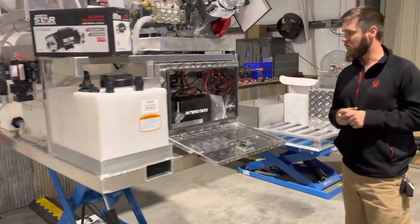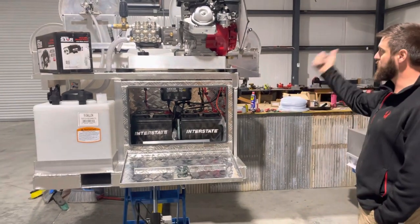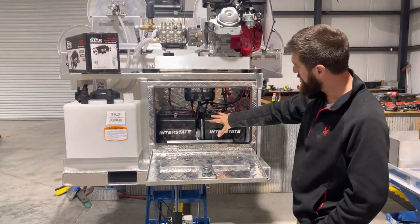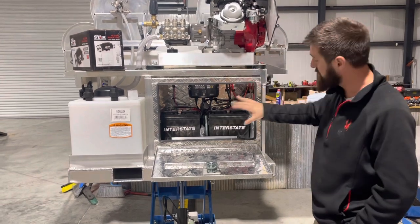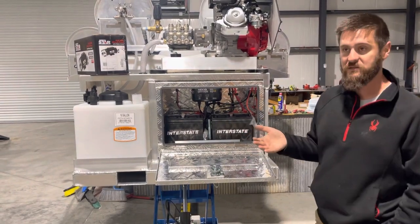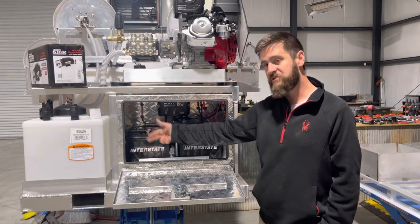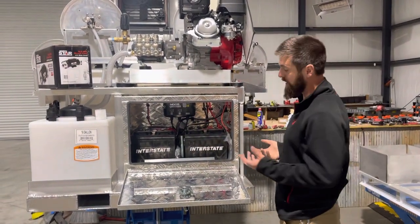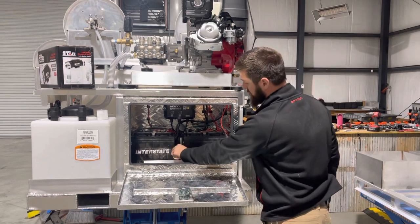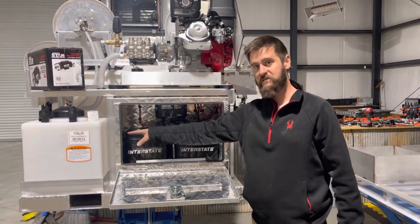There are a couple of things you'll need to do on the electrical side — obviously it's 24 volts, so a little different. This is our standard setup: we've got a 12 volt pump on this side, 12 volt pump on that side. Each has their own independent battery bank wiring — everything is independent, so if something goes wrong on one side, the other side is still operational. If you're running a dual setup like this, drop another battery right here in this pocket, run these together so you've got 24 volts. You could also drop a fourth battery and run these together as a 12 volt setup — so a larger 12 volt bank on one side and a 24 volt bank on the other.